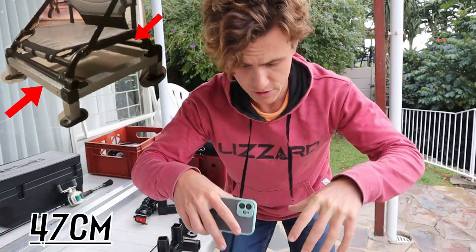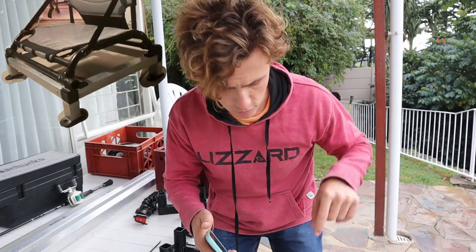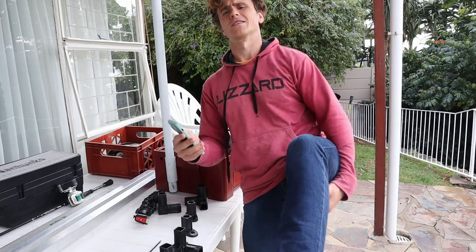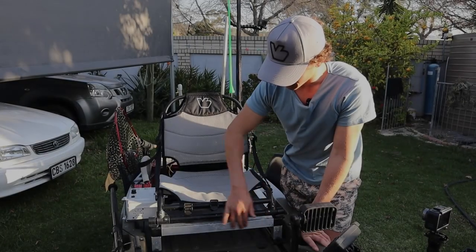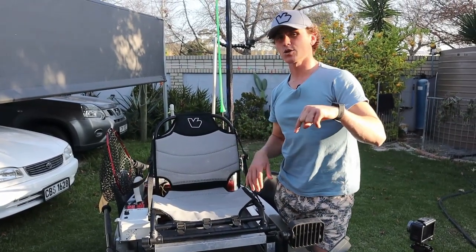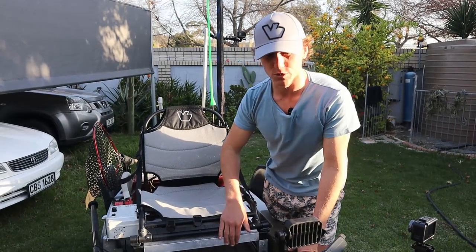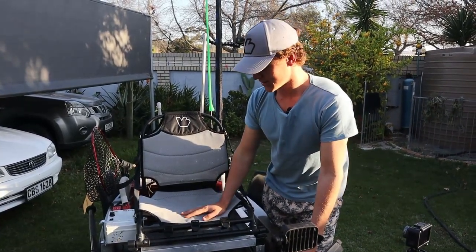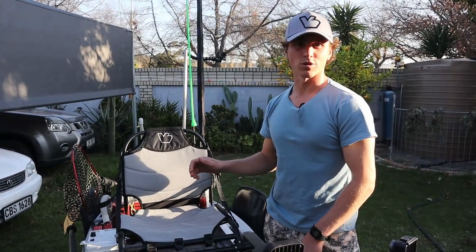So: the two 47 cm pieces are for the front beam and the back beam when you're sitting in the chair. The two 42 cm pieces are for the sides, and the short ones go straight up vertically. You just buy aluminum tubing — I'll put the diameters in the description. I think all the Van Lang SkyX models have the same seat size, so it'll work for everyone. Be sure to tighten it properly on the slide tracks — I didn't do that and my seat slid around on the water, but after tightening it I haven't had that problem.